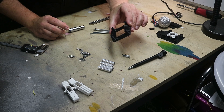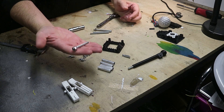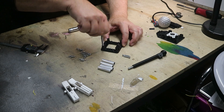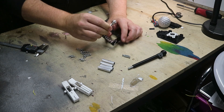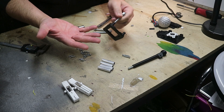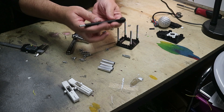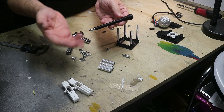First, grab the top of the unit which has the keyways and bevel, then insert the six millimeter threaded rods and put a locking nut on each to give a bit of traction. Tighten until it just starts getting tight — don't go too tight as it's not load bearing and you'll split the plastic. Do all four bolts. Then put the threaded rod into your gear stick shaft and go all the way to the bottom — don't skimp on that or wherever the thread ends it'll snap.